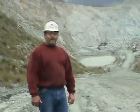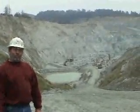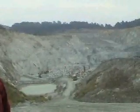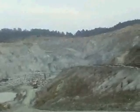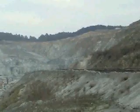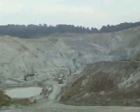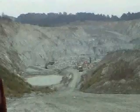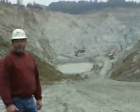About a half a mile behind me, you can see Granite Rock's active pit. Before we can remove the rock, we have to remove the overburden. If you look up to the tree line, you can see just below that is the overburden — the top soil that sits on top of the rock. We use scrapers to remove that overburden so that we can blast the rock and harvest it. You can see the active face down below me with the different benches. They are all active mining areas and currently we are down at a lower level. From here, we are going to take you through the whole process from the drilling all the way through to the finished product.